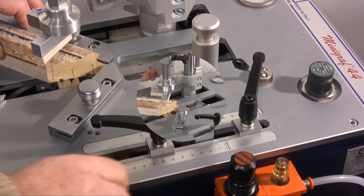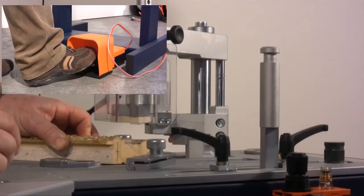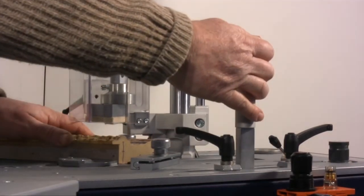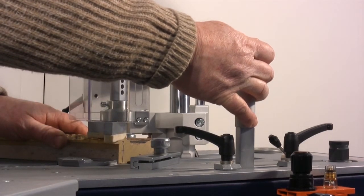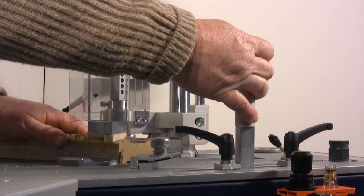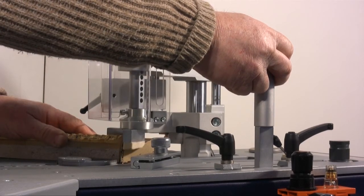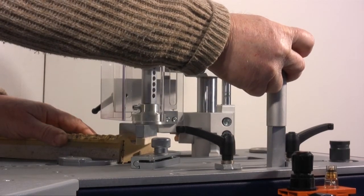All that's left to do at this point is to insert the wedges. Firstly we have to put the plastic protection down otherwise the machine won't work. We then have to press the pedal to make the horizontal presser work which keeps the frame's corner blocked. Then with the right hand we press the button on top of the joystick. Pushing the button half way makes the vertical presser lower. Pushing it all the way down makes the wedge come out and penetrate the frame. Pressing it another time makes the second wedge come out which pushes the first wedge upwards. We now move the trolley and make a wedge come out in the second position, and finally another wedge in the third position.